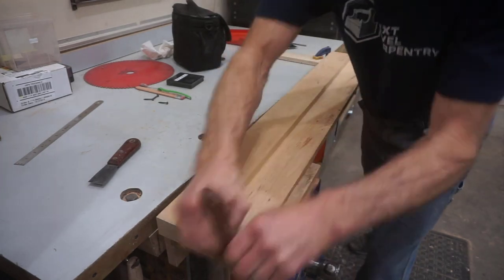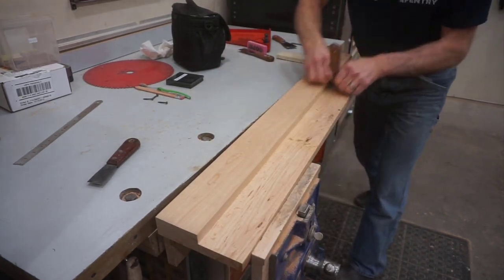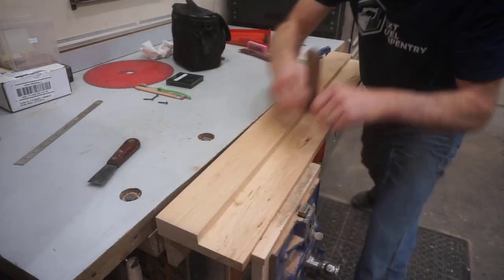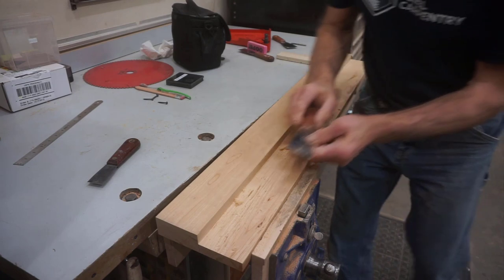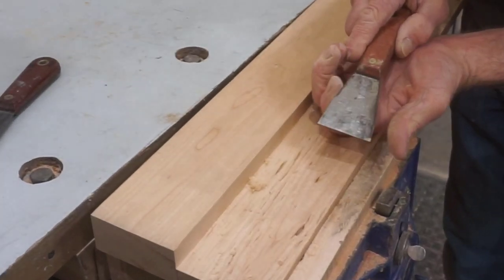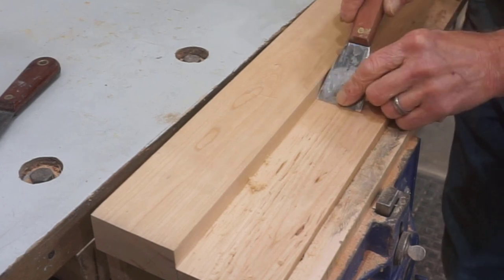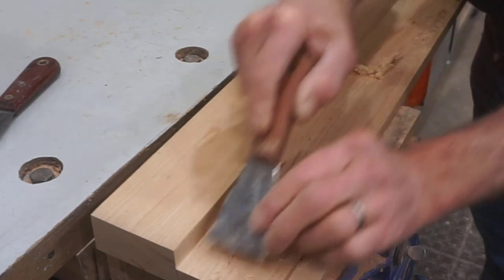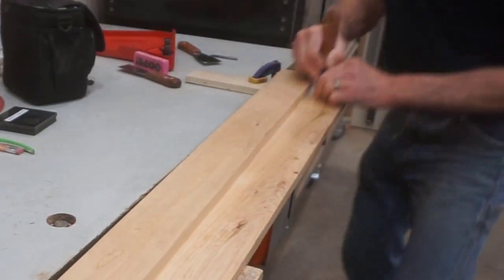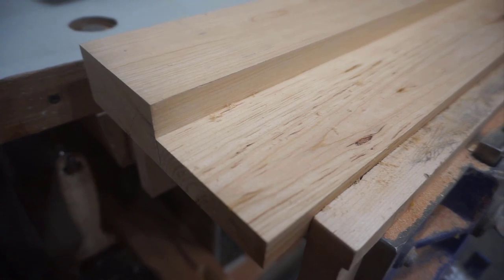And to completely eradicate my mistake and reestablish my position as a carpenter, I use a sharpened putty knife like a card scraper to remove the faint marks from saw teeth when I made that deep rip. The nice thing about a putty knife is that it has this acute angle on the edge, and the corner of the knife gets right into the very corner of that rabbet, so it's crisp, sharp, clean, and square, without a sawtooth mark to be seen. And that is a wabbit I can wiv with.